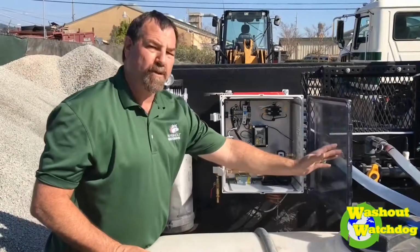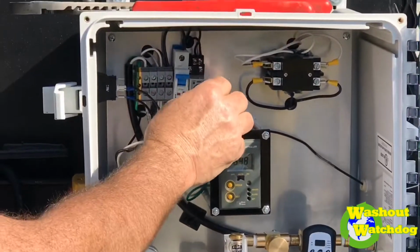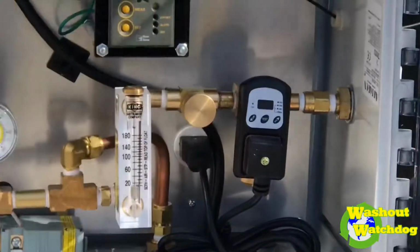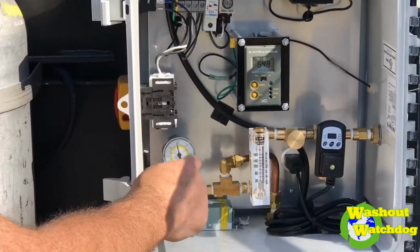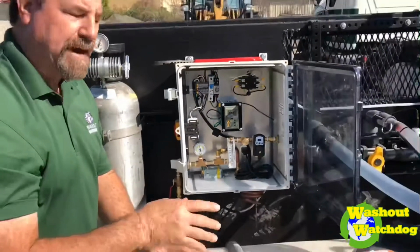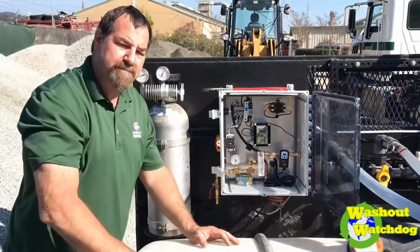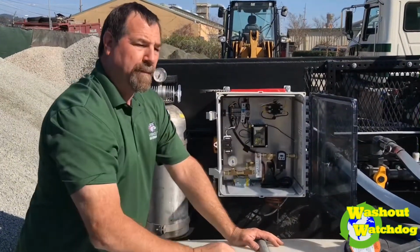So I wanted to walk through what we've got. We've got a dosing system that's set for 30 minutes. It can be turned on and off. So this pump's going to run for 30 minutes. But this is what doses the gas in. We have our gas in, it's on 30. There's gas pressure here, but there's nothing dosing. You would hear a click, click, click, click back and forth when it doses. So it's just going to run. And if this were to go above the 7.45 that we've set it to now, it would give it a little bit more gas.